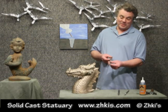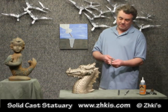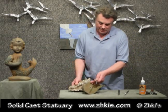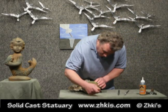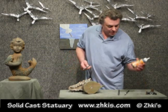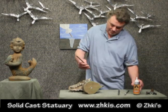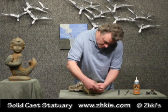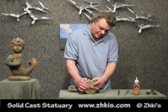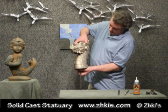When you ask for rebar, they're going to try to sell you a 10 foot piece, but they usually have it cut in 12 inch and 18 inch lengths as well. Here we're just going to insert it into the bottom. If you drill a hole that's kind of loose, I recommend taking some Gorilla Glue — it is an expanding polyurethane type foam glue. Put it on the ends and just push it in until it bottoms out. That foam will eventually come right out and you can trim or grind it off after it's hardened.